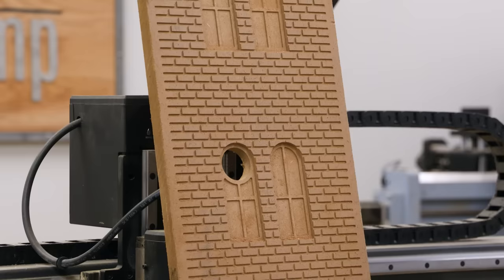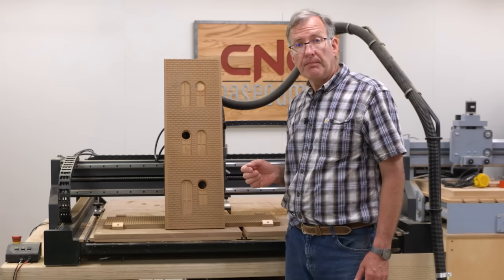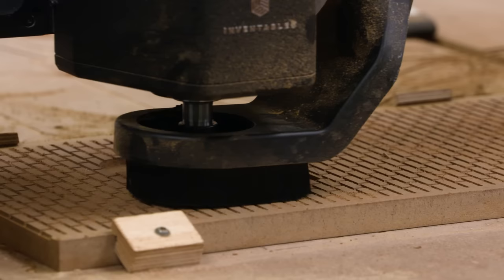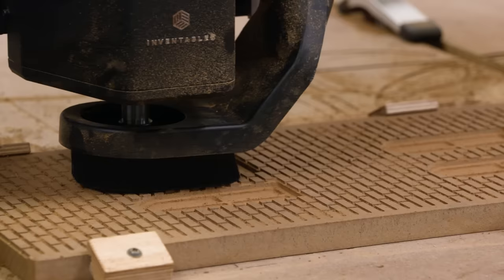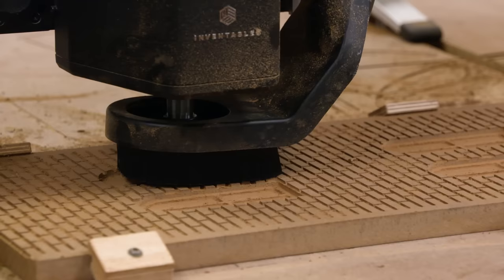For me it was the tall windows and the arches, really trying to get a sense of the vertical — being a birdhouse of three stories, it all laid out easily. The windows, as mentioned, are pocket cut about 3/16 of an inch deep and then the frame created with another 1/16-inch cut. Keeping things simple is easier to paint, and for something like a birdhouse or dollhouse you really can go too far with details to the point where it detracts. For things that are outside, you want to exaggerate the details and make them more prominent and a little larger because you're viewing from a distance. Go for the feel of it — it'll serve you a lot better.